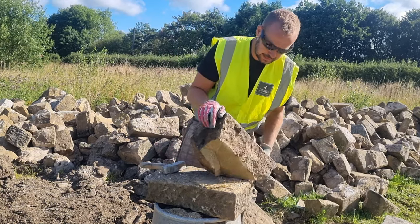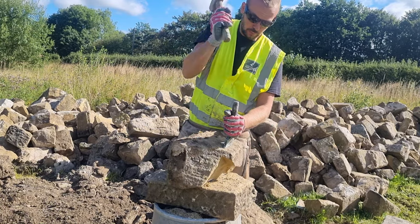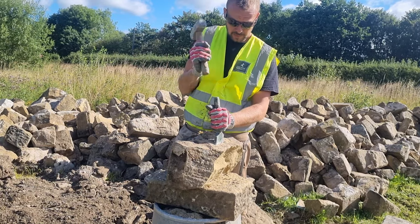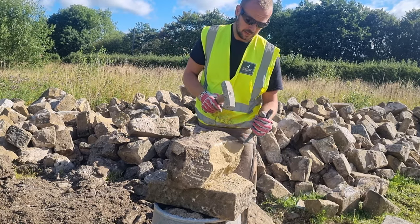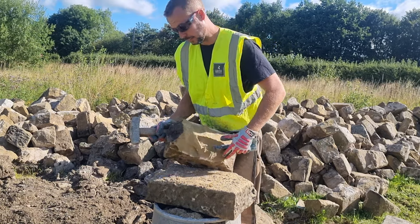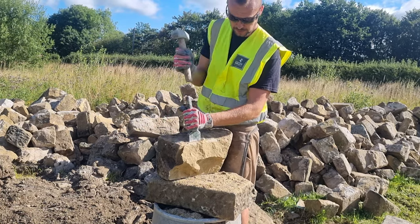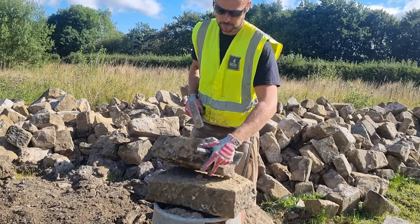This stone is a sandstone — as you can see it is quite chewy because there's not a lot of natural beds in it, so it does take some getting off. See how that's bellying out on the back — that's very tight, and once again doing it to that bed size makes it that bit more tricky. It requires an extra bit of work to get it flat on the back and also to prevent it from going under.